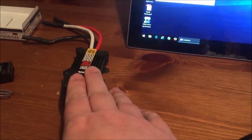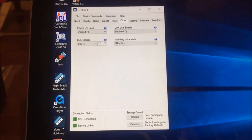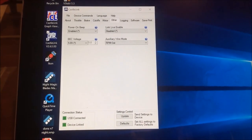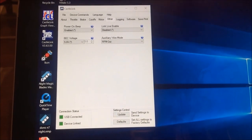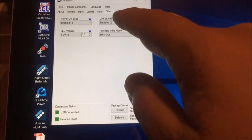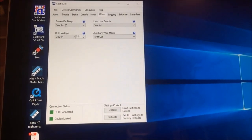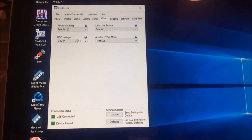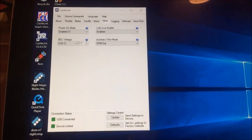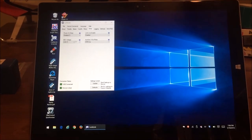Now I have my Castle Edge 100 hooked up to my Castle Link. This unit already has the most current firmware, which is good. Using the telemetry link does not mean you have to use the Castle governor — you still have full control of the auxiliary wire. You can set the RPM out, put the throttle setup in external governor mode, and that part won't function at all. The only thing that's really necessary in the ESC for telemetry to work is that you have to turn on Live Link. If that's not on, you're not going to see that data travel through the Castle Link. You have to have the newest firmware, version 4.22, and Live Link needs to be enabled.